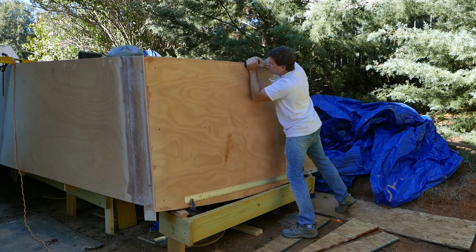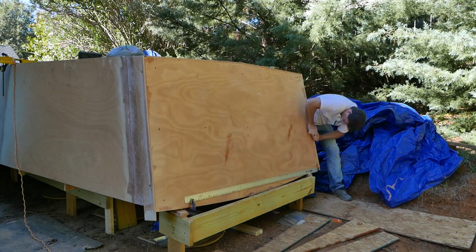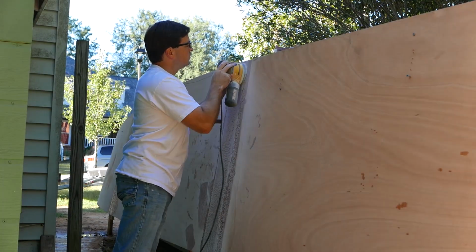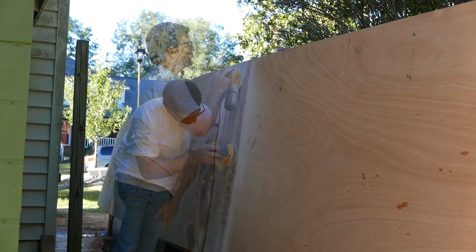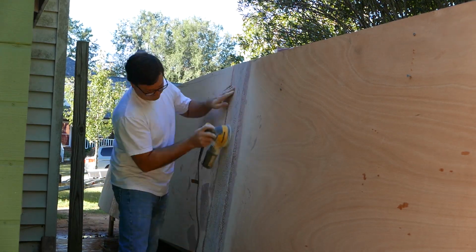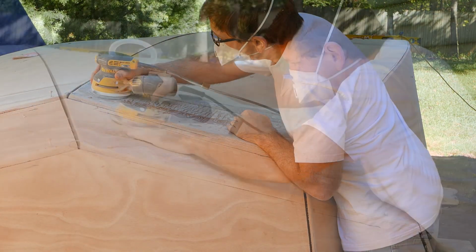The fiberglass tape that was used to join the hull panels to full length was plenty strong to hold the panels together, but despite our efforts to press it flat while curing, it showed noticeable creases and voids. We spent a lot of time sanding the tape flat, but eventually decided the splices needed to be removed entirely, which we found easiest to do with a power planer.